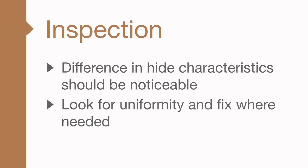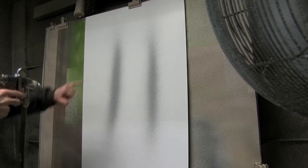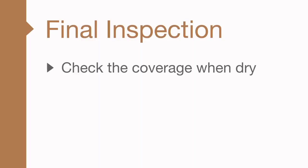Once the wall is tacked up, you're ready for the pattern step. Adjust the air atomization pressures to the pattern settings — paint pressure will remain the same. With the gun 12 to 14 inches from the surface, the fan size should be 12 to 14 inches as well. On a scrap board or masking paper, do a quick test spray to check the particle size. You will also notice the fan size increases. Begin west to east or east to west, 50% overlap, feather to prevent banding. Next, north to south, 50% overlap, slight feather depending on wall height. Walk the length of the wall and you're done.